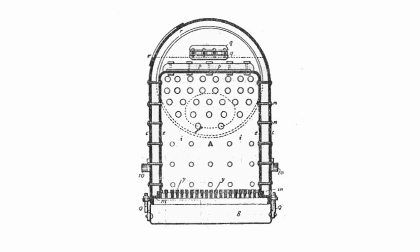These are iron girders spanning the length or width on the outside of the inner firebox. The crown sheet is bolted to these. The force on the ends of the girder stays is supported by the ends or sides of the inner firebox. The upper part of the boiler barrel lies unconnected to the firebox. This has the advantage that a large hole may be cut in the boiler directly above the firebox to mount